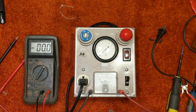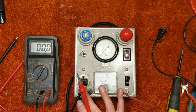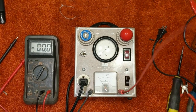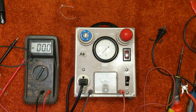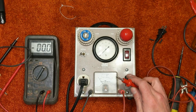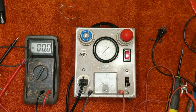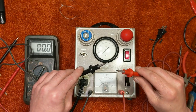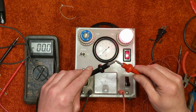So we've got nothing here. And as we showed when we did the test, when it was switched to the 115 volts, there was no voltage on our banana jacks. So we'll switch to test. Get the leads up on the table. I don't want to be touching them. I don't know the quality of these things. They're old military surplus leads. So switch to test. All right. Our indicator comes on telling us that our jacks are live. And here's where we shot out smoke and sparks the last time. Well, that was uneventful.